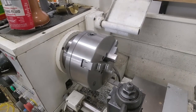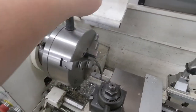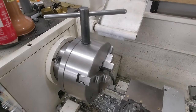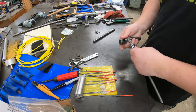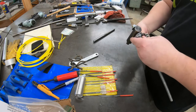The big one is replacing this chuck key for my three-jaw. The crossbar has been falling out, and while I could just attach it more permanently, I had an idea for an improved version. The three-jaw chuck is pretty cheap and its action is very stiff, even immediately after cleaning it. I usually use both hands when adjusting it, which is a pain because then I don't have any hands left for holding the part I'm trying to chuck — so I thought maybe adding a crank handle would make sense.